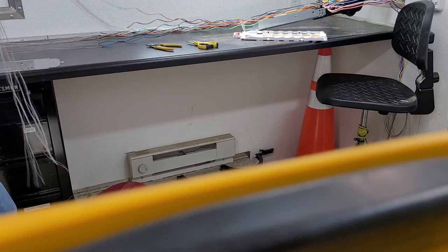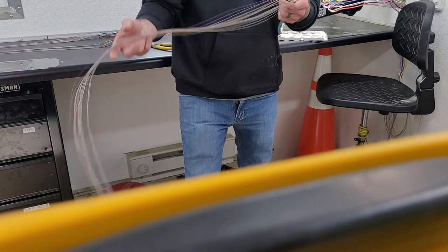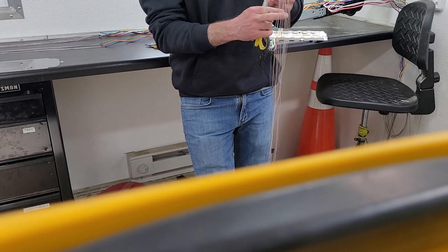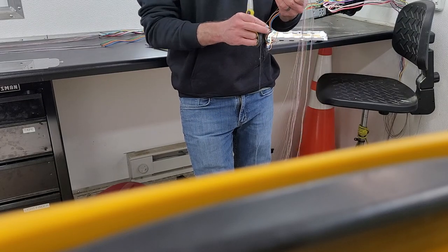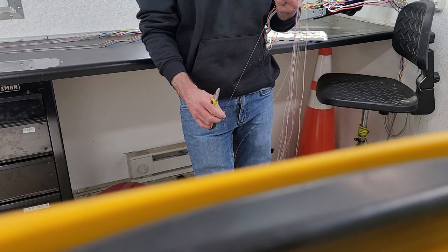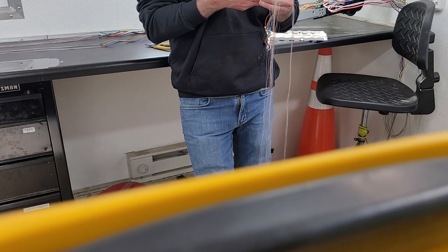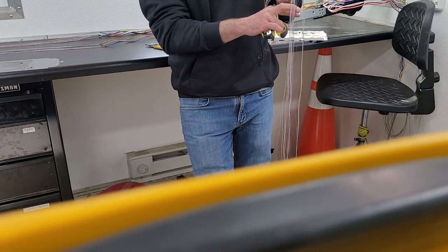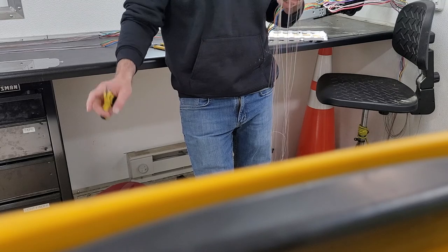Alright. Okay. I'm going to show you something else now. Inside each of these buffer tubes, there's something I want to cut off, more strings. The way you're going to tell the difference between these strings and the fiber is it's rigid. You can feel the roughness of the cotton or probably Kevlar. Just go ahead and snip that off. Just like the fiber, it's very annoying. It gets stuck to everything. It sticks to your boots, sticks to your floor, and you'll be dragging a bunch of strings around.